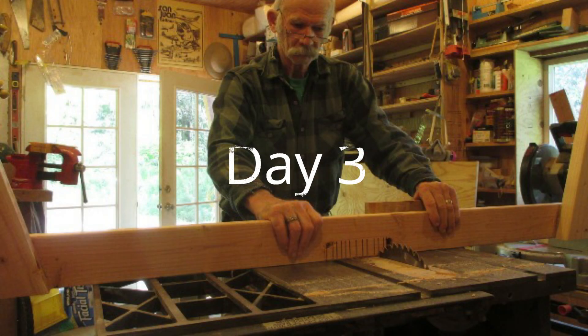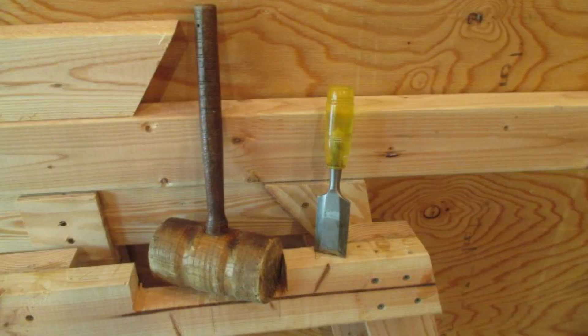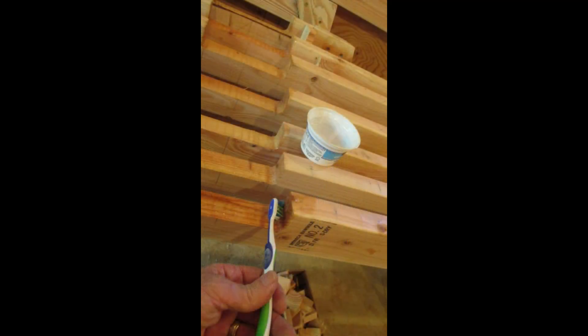To make cutouts in the bottoms of the frames to accommodate the keelson, I drilled two half-inch holes in each frame, centered an inch and a quarter above the bottom, and three inches either side of center. I set my table saw blade up an inch and a half, made many cuts through each frame between the holes, and knocked out chips with a mallet and chisel. The slots are half an inch wider than the keelson on each side — limber holes to allow bilge water to flow all the way to drains in the stern.